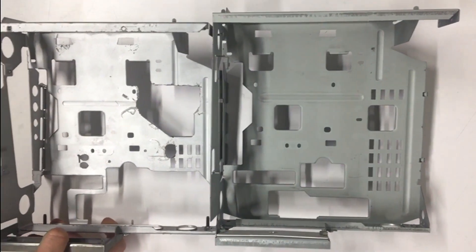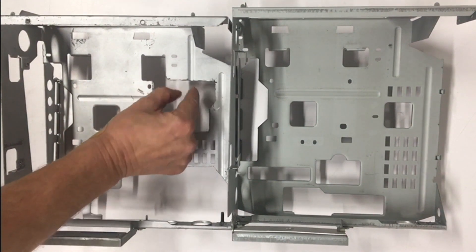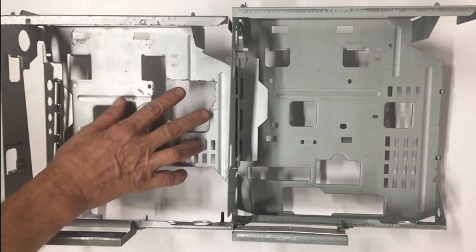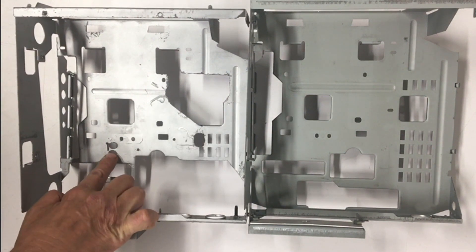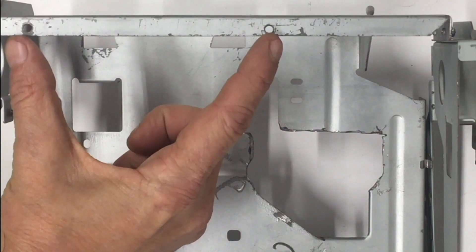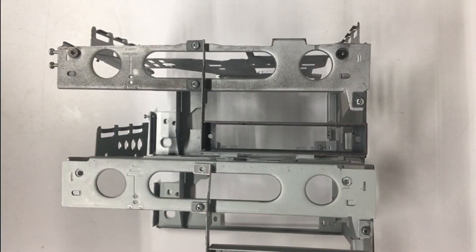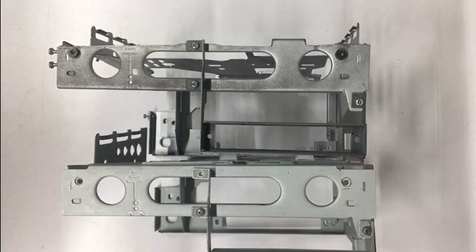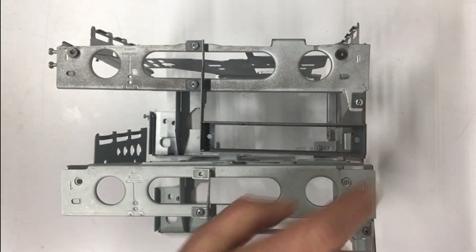Towards the upper left you can see where I have a cutout for the SCSI cable and for battery access. Then you can see the mounting holes that I had to drill for the stereo speakers and the metal I had to remove to get clearance for the Ethernet card. Towards the front we have holes that are drilled for the LCD board driver bracket. And on the rear you can see where I had to remove metal for the Ethernet card, the RAM, and for the VRAM. Now we can just slide the board in.